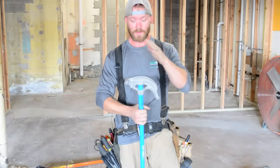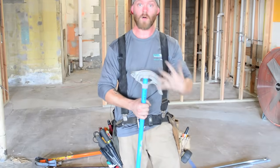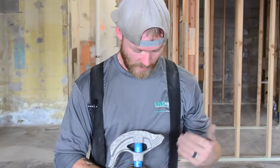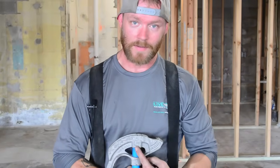First thing that I wanna talk about is the bender in general, just familiarizing yourself with what all the marks on a bender mean. The bender has a lot of different marks on it, and just knowing what the marks are is really helpful. It tells you what size conduit you're bending. This says 1/2-inch EMT only. That means not 1/2-inch rigid.